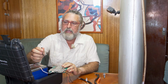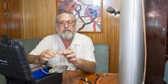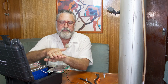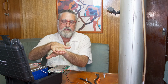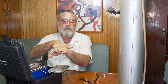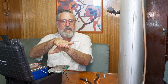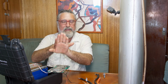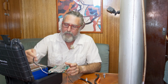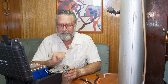Also, there's another mobile temperature sensor, and this one is just a switch. I think they're called bimetallic switches, and there's 2 metals, and they just expand differently. So when the temperature goes above the danger temperature, the switch kind of goes click and shuts off. So it shuts off the BMS. We'll just shove that into there because it'll know what the batteries are doing.